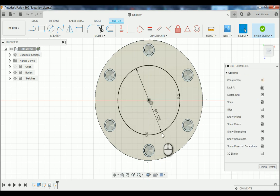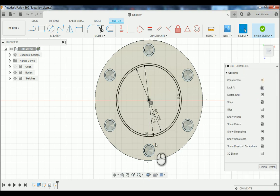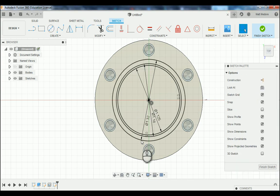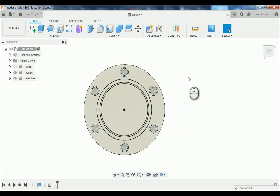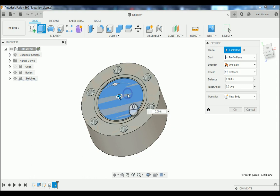C again on the keyboard — the outside diameter of our groove is 1 inch 320 thousandths, and press Enter. We're going to finish our sketch, right click, press and pull. This will allow us to extrude our geometry. The first geometry we'll look at is our pocket — the depth is 500 thousandths deep. To change the direction of the pocket, we put in the minus symbol: minus point five hundred. That will subtract material down. Notice the operation in the pop-up window is Cut — press OK.